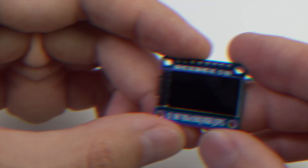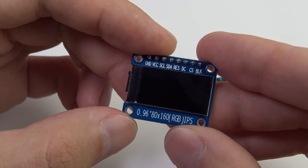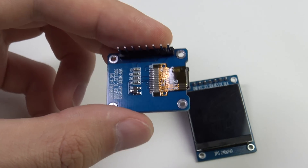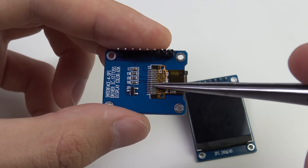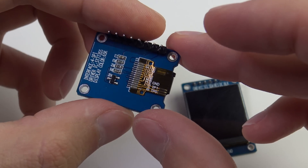Due to the slowness of the interface, full-frame updates will result in a fairly low refresh rate — I will show this later in the demo. The display controllers support several interface variants: a parallel interface in several configurations and SPI. However, the parallel interface lines are not exposed on the connector — neither via the board nor via the ribbon cable — so there is no possibility of using parallel mode with these displays.